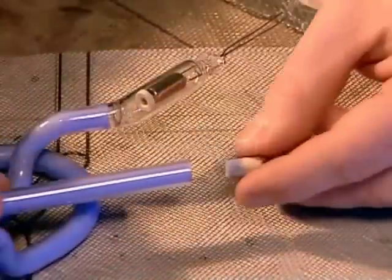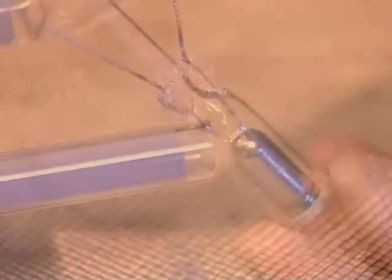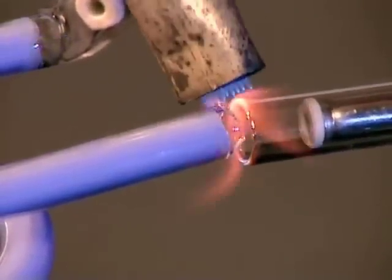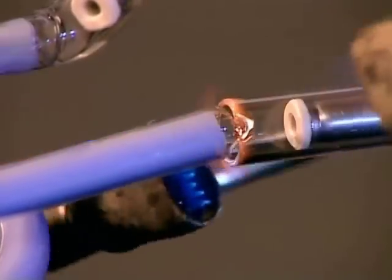After shaping, they cut off the excess and rub the coloring powder off the ends. Now they can attach glass casings which contain electrodes. They fuse an electrode to each end of the tube using a propane hand torch and a flexible latex blowing tube.